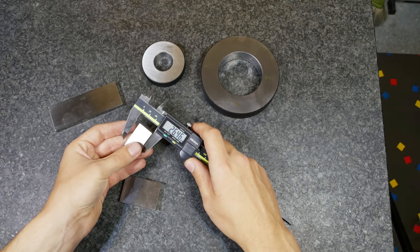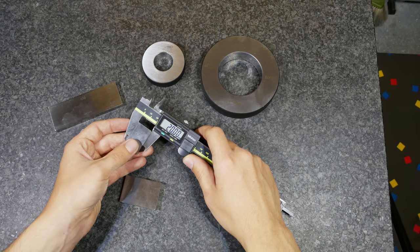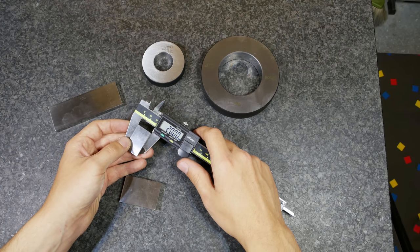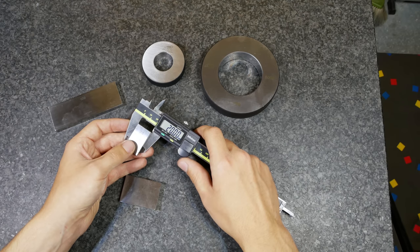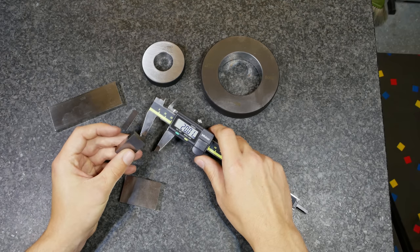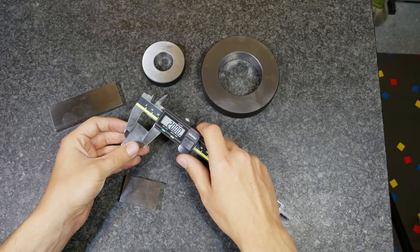For example, here for the outside dimension, I cannot measure something that is smaller than the actual dimension. I have to always apply the same pressure on my thumb — that's the basic. And the second thing I ask myself is: what alignment is critical to get good measurements?